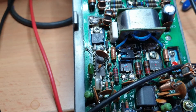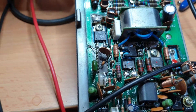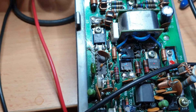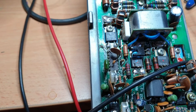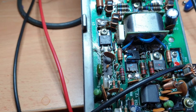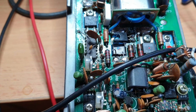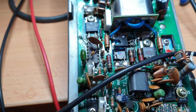This is sometimes the problem with us repair-type guys — we get something in our mind and go chase it, and the truth is we're just not doing the obvious. I went chasing a PLL fault on this about a month ago, and to be fair there were a couple of cut diodes that shouldn't have been cut, so I'm glad we uncovered that. But my gut feel should have been to go straight into the output stage and check these driver transistors — they're such a known fault. As you can see from the metering we just did, they are as dead as dead.